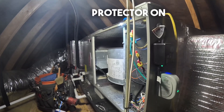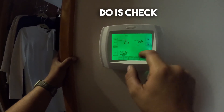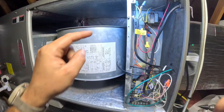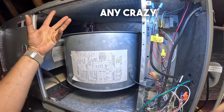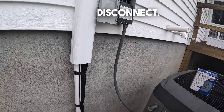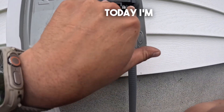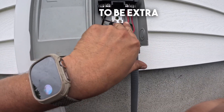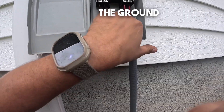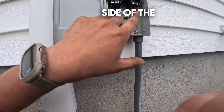It's time to go outside and put another surge protector on the outside. The fan doesn't turn on right away — one of the first things you should do is check the thermostat. As you can see it is waiting because it's on a five-minute delay. The blower is on now, not making any crazy noises, and it sounds so much better. Pull out this disconnect — the line voltage is still live. Luckily today I'm only working on the load side so I'm going to be extra careful. We'll pull off these two wires and the ground wire for the condenser on the load side of the disconnect.